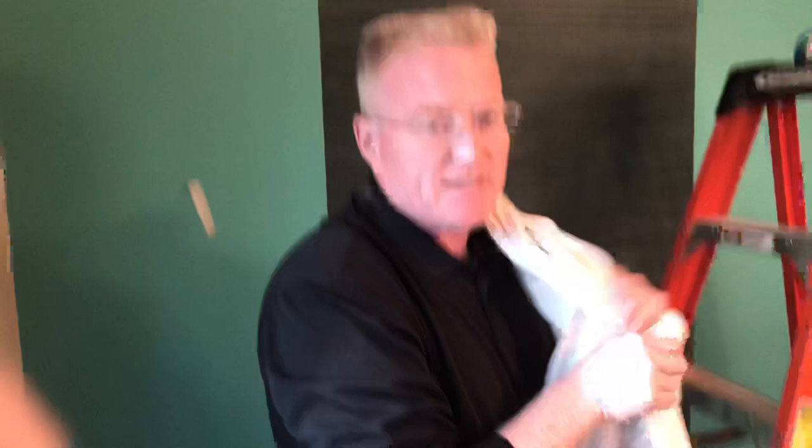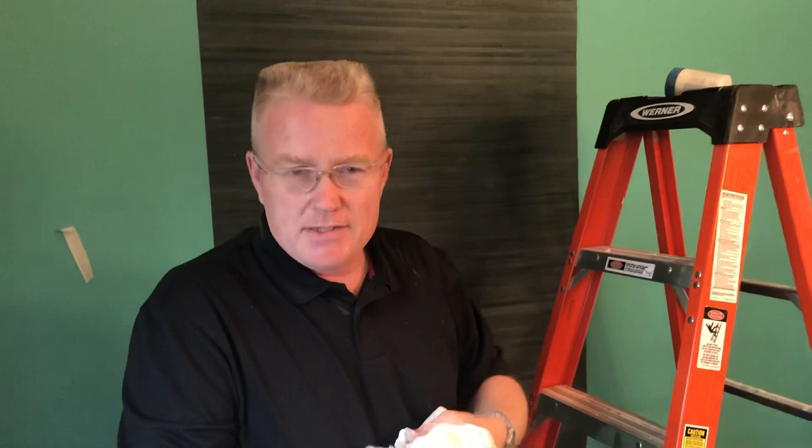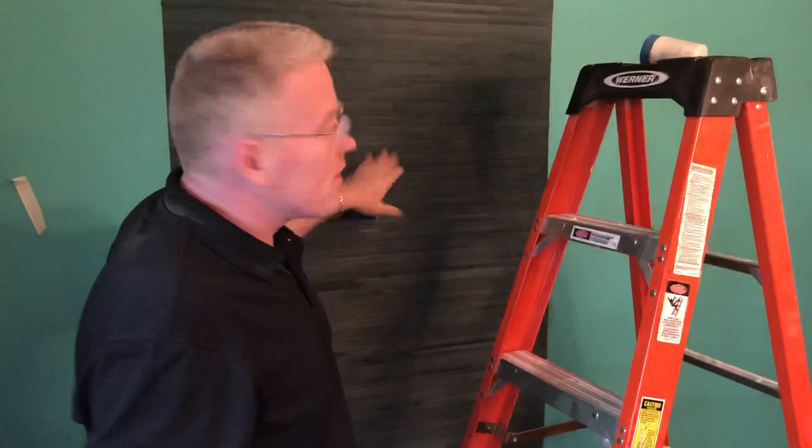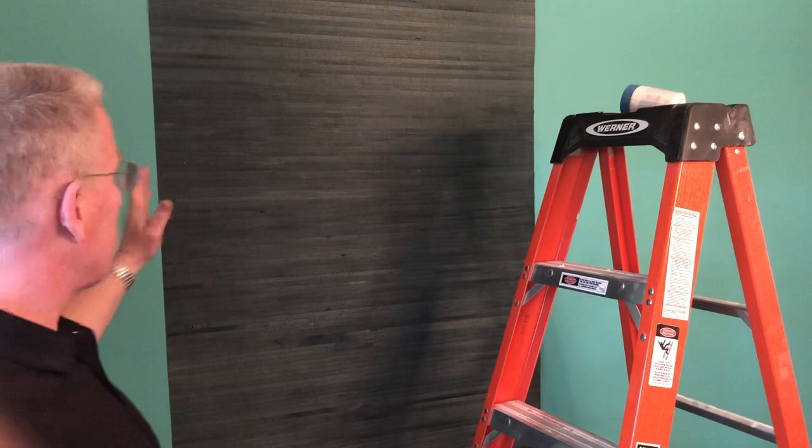Look at the beauty of this wallpaper. As a professional, one of the benefits is you don't get air bubbles or trapped air pockets. This is a natural product — the air comes in and out of it even though it has a backing — so you won't have the problems you'd have with vinyl. I'm going to use my smoother to smooth it out. That's how we plan a straight line. I'm not ready to cut it into the corner yet — for that we're going to use a steamer to heat up the wallpaper so we can bend it into the corner. We'll do a video on that. If you like the video, click like, subscribe to my channel, and I'll see you on the next one!